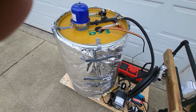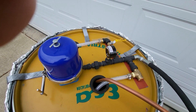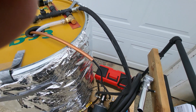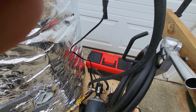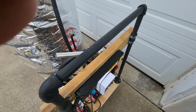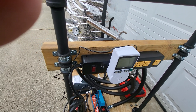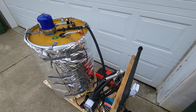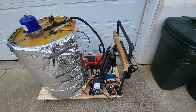Another thing I did — you can see this copper pipe here — this is a temperature probe. I took some old coax cable sheathing and put it around the wire to protect it. That goes to a thermostat switch so I can limit the temperature that my oil gets to and I don't have to sit and watch it constantly. I do recommend that if you use one of these systems, you do not use it in a building, just for safety.